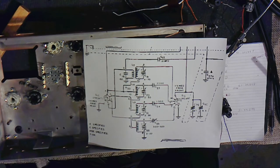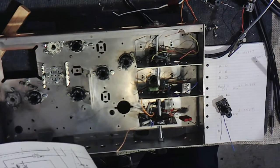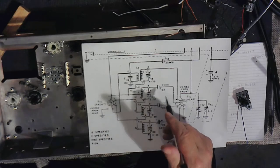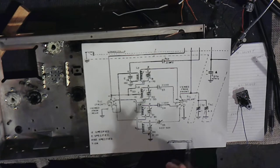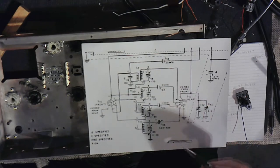Switches are a key component of communication receivers, and I used to avoid even thinking about them. You know, maybe I can do all this stuff without ever coming to the switch, but doing a thorough cleaning job and everything else, I've had a lot of issues. Even if you keep these mica capacitors in here, there's still a tracking problem, and having to switch out and find the right capacitance for the receiver today versus back then results in the need for being able to get in and out relatively easily. So I'm reconstructing this as best I can to make it easy to switch these out if necessary.